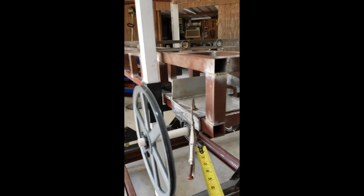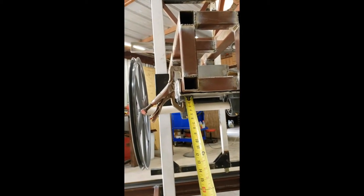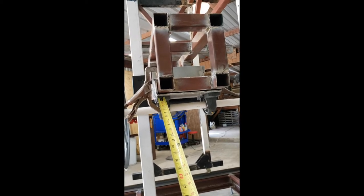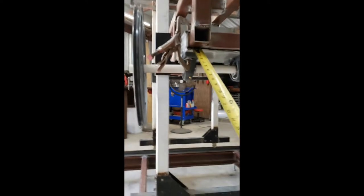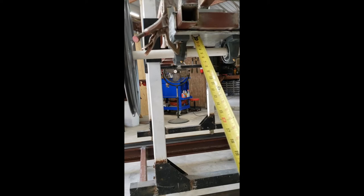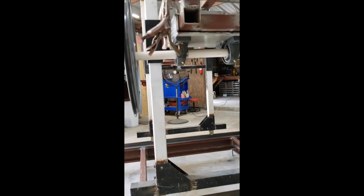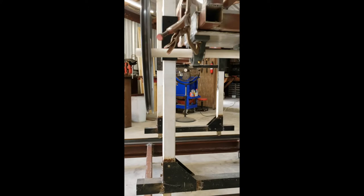So what I'm thinking about doing is mounting these things on the bottom. I'm going to have to weld in a shaft — luckily I've got enough room underneath to drill a hole where each bolt will go all the way through, bevel it down at the end, and cut this off. I'll weld on the studs basically straight onto this plate, but it's going to have to be very strong so there's no risk of this thing snapping off. This gives me almost a 12-inch cut, which should be more than enough.